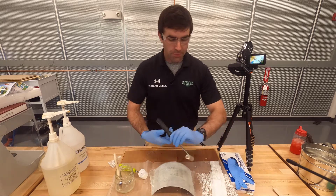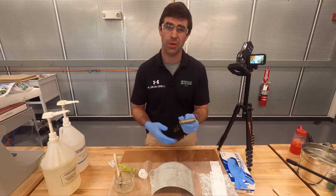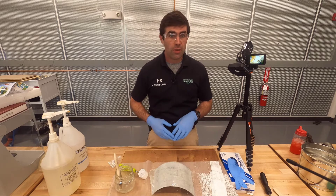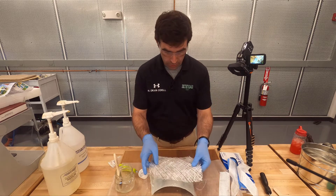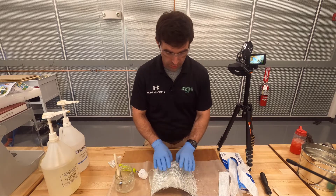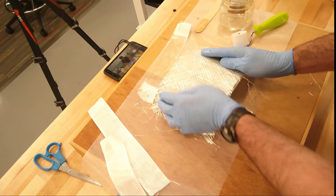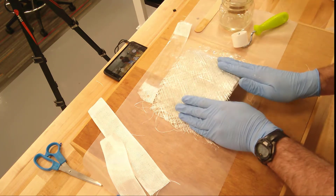They make lamination rollers with special gaps in the roller so they're not too difficult to clean. You run this over to push out air bubbles. So this is our first layer — typically in a layup you'll have more than one layer. So let's add some biaxial cloth. I'll just place it on there. We've already got resin, so it's going to stick pretty good, and just with hand pressure it'll start to wet out because there's a little bit too much resin on that first layer.